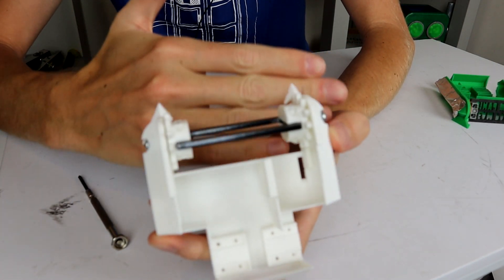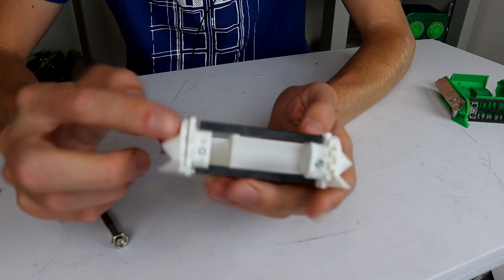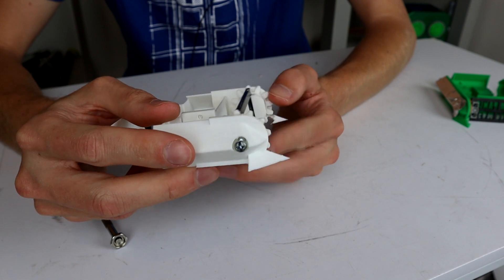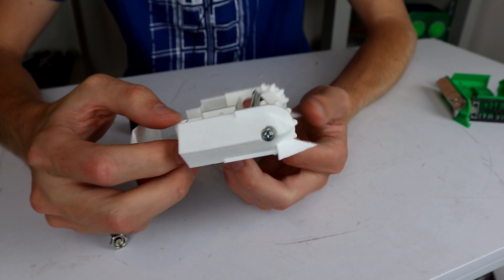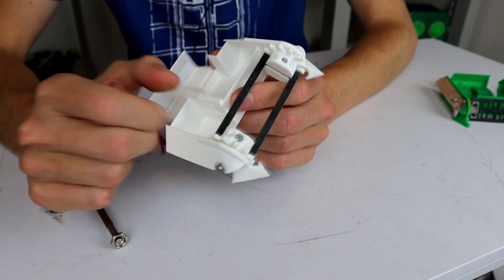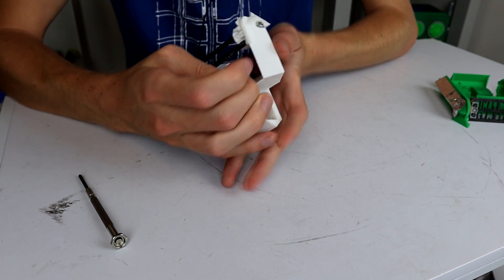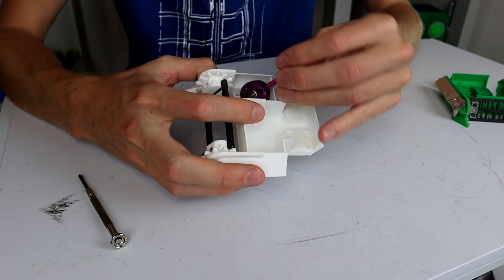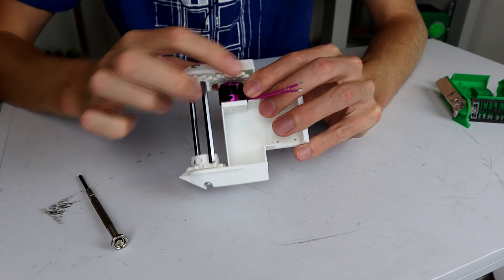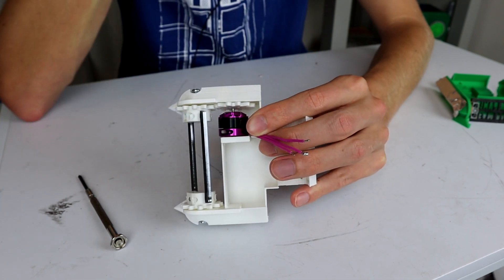So this really hasn't gone according to plan. The gears - I knew they were going to be a little bit oversized but I did not realize quite how much. You can see they stick up over the edge of the armor plate and they are actually larger than the weapon itself, so this whole thing is just messed up in a lot of different ways. And I need these gears to be this size so that we actually fit our motor in. The gears don't line up and they don't mesh properly either.